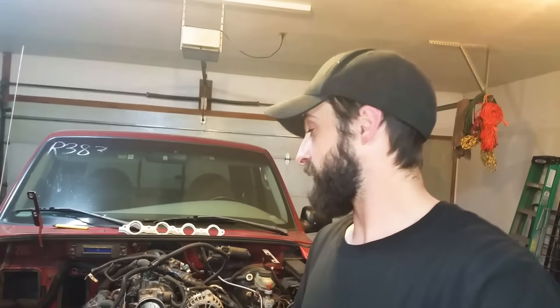I got the 35 thousandths wire because it's a little bit thicker, so hopefully it'll be stiff enough. And the bigger contact tips so it won't snag or catch inside there and buckle up and bind. We'll install it and try to do some welding. I want to see if this is going to work because when I do the cold side and the aluminum piping, I'm going to have to cut and try to make some stuff fit. So I'm kind of preparing for that so I can make the tubing work.